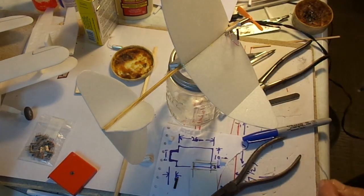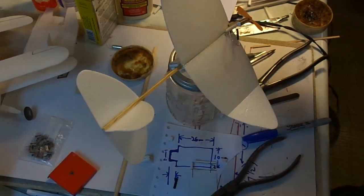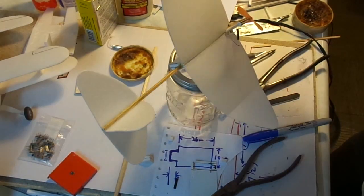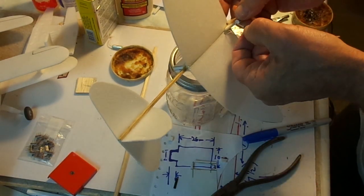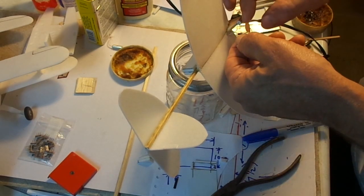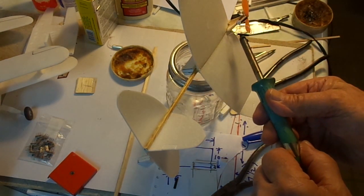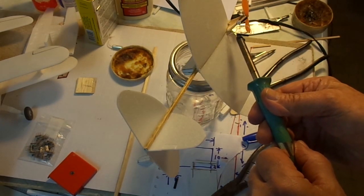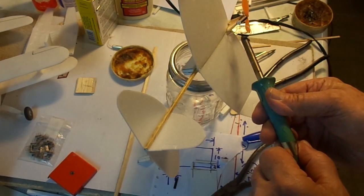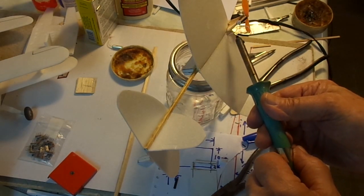There's the joint. I see the metal flow in there. That is the last solder joint. I'm going to unplug my iron. I'm going to put the heat shrink down over that. Use the last few little BTUs of heat to shrink it down onto the wire. And then we're going to take and pull that through.